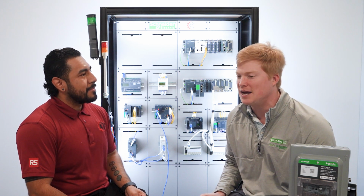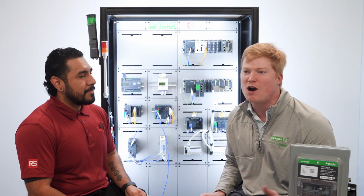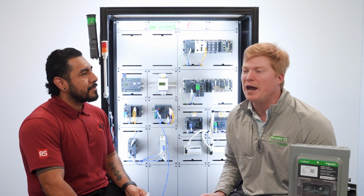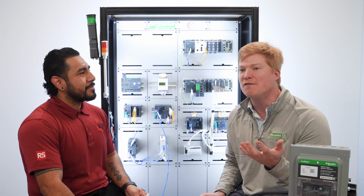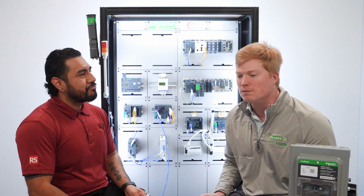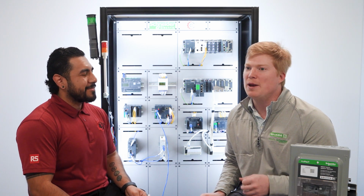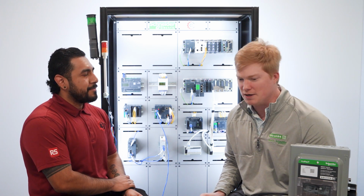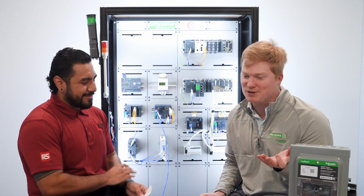Yes. So when we designed this switch, we really thought about the life expectancy of a switch and how can we maximize that. So NEMA has a standard, a KS1 test requirement, basically describing the life of a safety switch. And in their normal operation hours, they really require you to have a 2-year life expectancy. And we wanted to double that and have a minimum of 3 times that value in a strenuous environment. Right. Is what we wanted. So at Schneider, we like to say 3 times the life, 3 times the value with our safety switch.